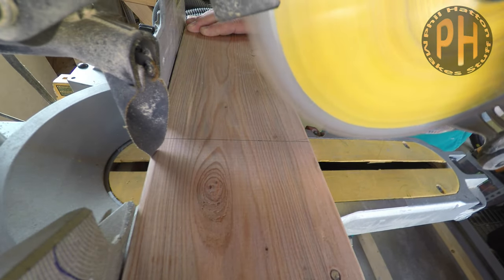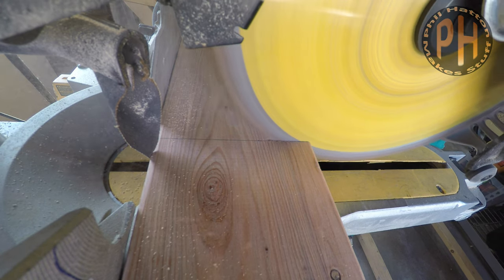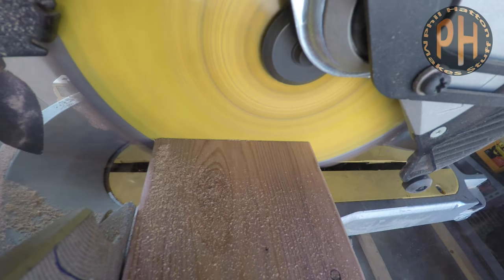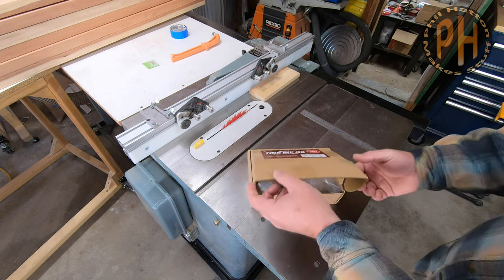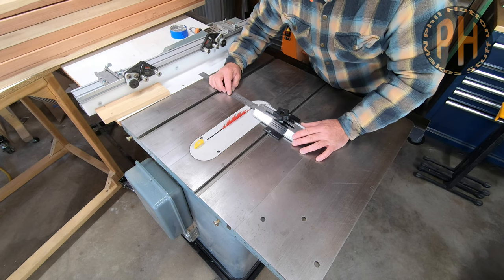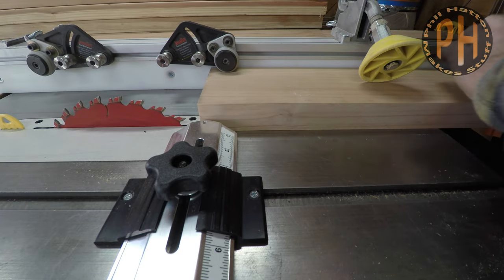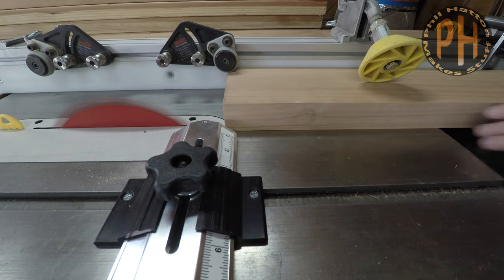So now I had a bridge, but it really needed handrails, and I didn't want to make them straight since the bridge was curved, and I couldn't make them in a curve that didn't match the bridge. Remember, the bridge has an increasing radius as you go towards the house. So I cut some redwood into strips, set some blocks on the bridge, and covered everything with plastic. This allowed me to clamp the strips into a slightly broader curve that matched the bridge. At first, I was afraid to cross the bridge before I added the handrails, but I got over it.